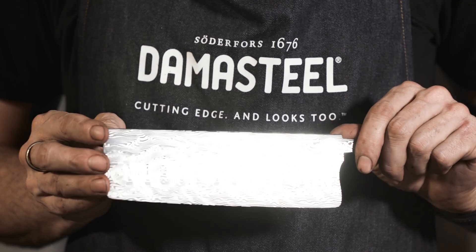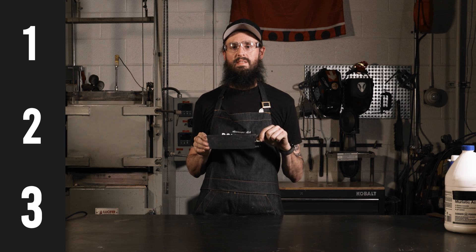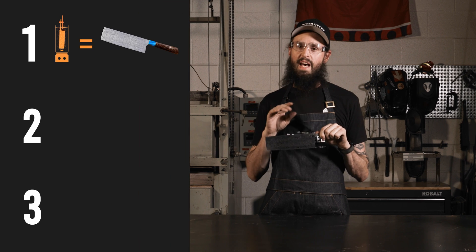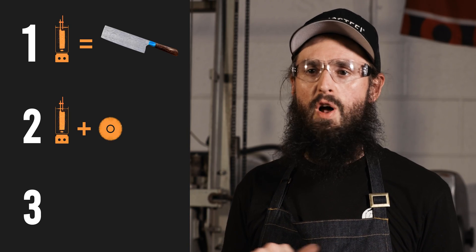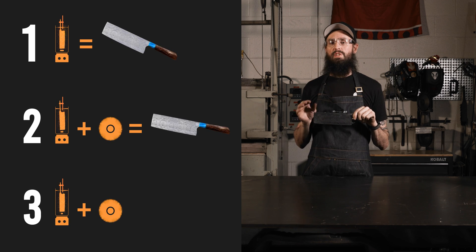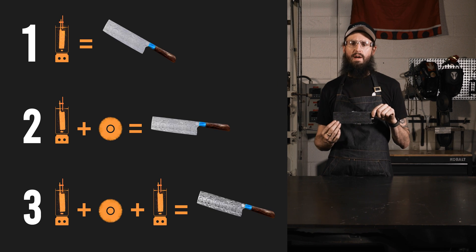That is how we etch Damasteel. We worked with the Grosser Rosen pattern in a Premo Nakiri and went through three different processes to get three different looks from the same piece of steel. First, a single etch for about two or three minutes, pulled it out, neutralized it, and called it done — that gives you a black and white matte finish Damascus. Or from there, take it to the buffer, buff out all the high spots, and create a two-tone finish with a shiny mirror on the high spots and dark low spots. For the third finish, go extra deep and return it to the acid after the buff to create that topographic pattern. Thanks a lot — John Phillips from Premo Knives, working with Damasteel Grosser Rosen pattern.